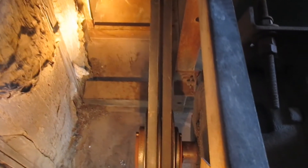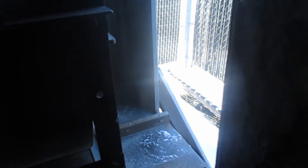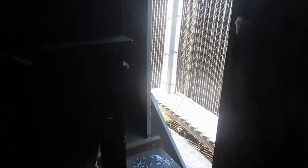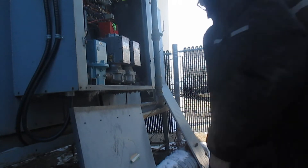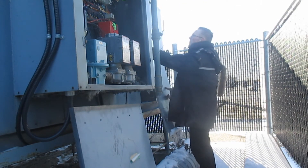That's how you put belts back on. If a belt gets damaged and flips off, you need to get a new one and put it back on. After having done all that, go back out there and reset the switch — turn the master switch on, push those reset buttons, and the ventilation system should work. Make sure you put these panels back on, because the system will not work very long without them.